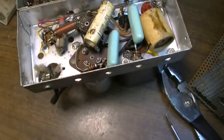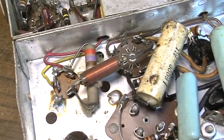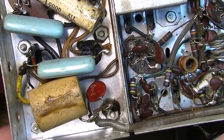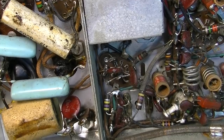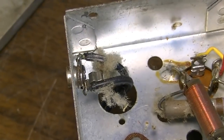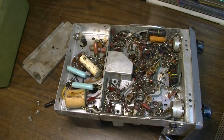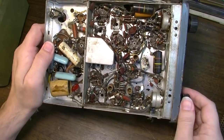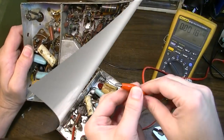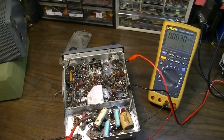Other than the vibrator, it's got a regular power supply like you'd see in a normal tube amplifier. I'm not going to change any caps or anything. I'm just curious if we plug this in, whether it would actually work. Let's look at the schematic and see where the power gets injected. That's not even hooked up to anything. Here's the switch — that's the power right there. So that's the antenna and that's the power.